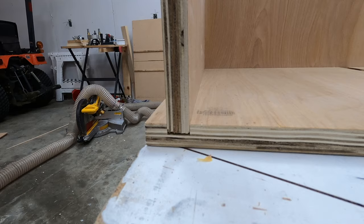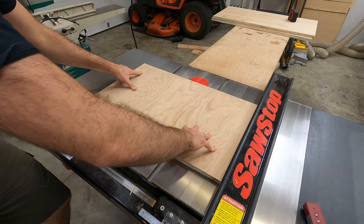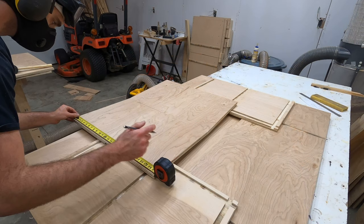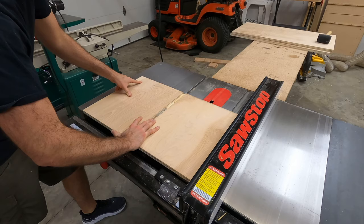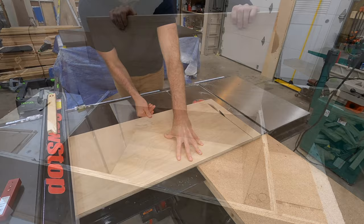While a little bit tricky to line everything up and get it to fit together, building with this type of joinery can be extremely satisfying when you put everything together and it finally lines up. On the outside panels as well as the inside vertical panels, I needed to cut more grooves for where the shelves would go. I put the fence in one spot, cut out the location on all the panels at once so they line up, and then just cross cut the other pieces to length so they would slide right down in those grooves making the interior shelf panels.